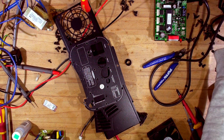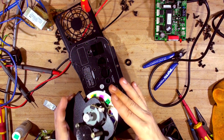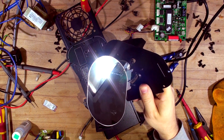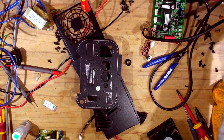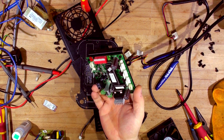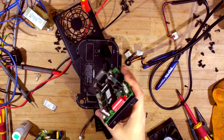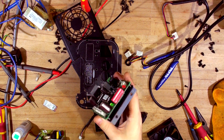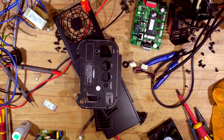I've cleaned all the ports, the optics have been cleaned and reassembled. Here are the optics and the mirror — cleaned and reassembled. You can still see that permanent dot on the mirror. I've replaced the LED and the caps on the board — the caps were at 1.7% voltage loss; usually 1.5% is when you want to replace them, so I replaced two caps. I also bought new screws to replace the rusted ones.